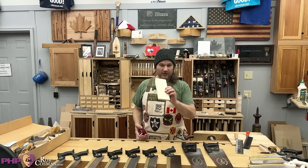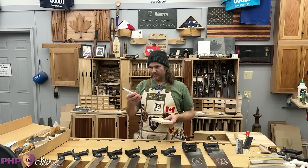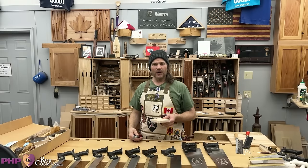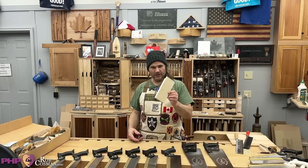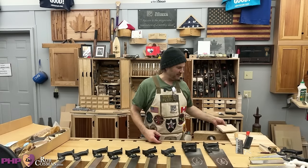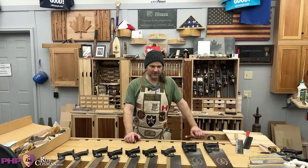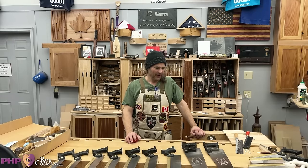If I wanted to know how much wood I need to actually start with, then I would take that 0.17 and times it by 1.4. And that would give you a number that you would then purchase in order to safely get this. That's allowing for checks on the end and defects that you don't find. 40% waste. Softwood, 20%, but hardwood, 40% to be safe.